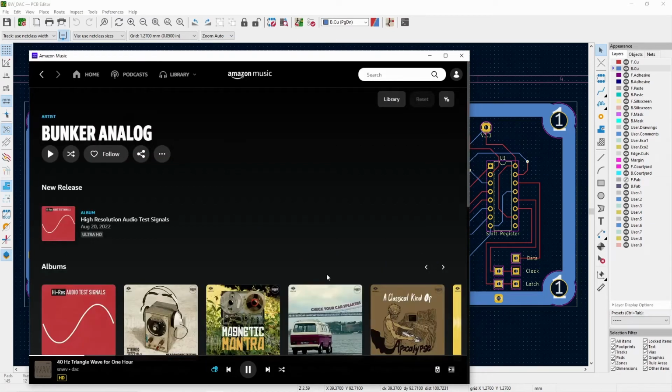And there's also other things that could be at play, like counterfeit components, for example. That op amp is supposed to be one of the TI ones, the one that's real famous in the audio community. Can't think of the number. But the little Texas on the TI is pretty smudged. I'm not sure, it might be counterfeit. So if the op amp might be counterfeit, maybe the comparators are, or maybe I didn't pick a good comparator, one that's clean. A comparator should not pass any noise from the digital input onto the output. That's the point of it. Well, that and to jump it to a different voltage. I mean, the comparator can run at any voltage.